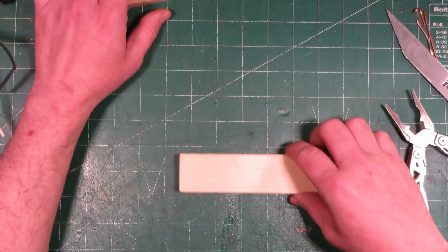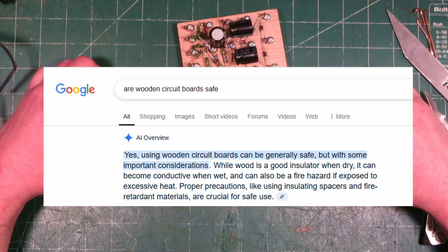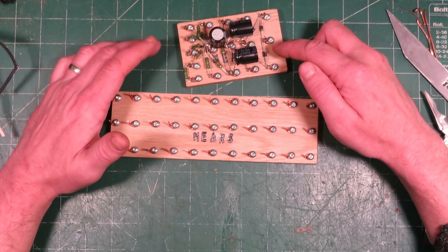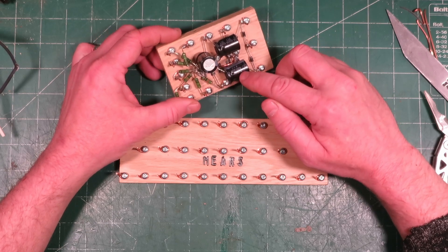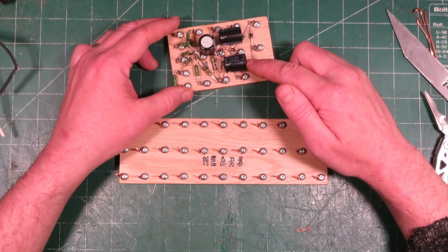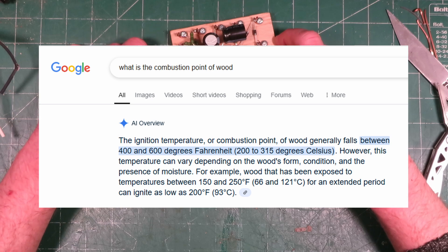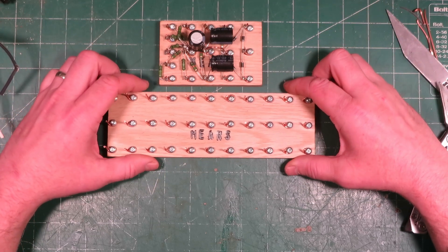A couple of friends have wondered whether a wooden circuit board is safe to use. I looked into it and it is. Although there's always a concern for fire, here's what calms my nerves: the components I install — like these capacitors rated at 22 microfarads up to 450 volts — are rated to 105 degrees Celsius. After a quick search I found the combustion point for wood is much, much higher than that — hundreds of degrees. The components themselves would likely catch fire before the wood would.